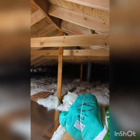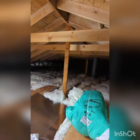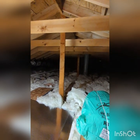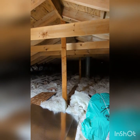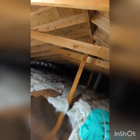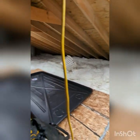The air handler is 21x57 inches, so I might have to cut some of this joist and then rebuild it, or see what I can do. But mostly so it's not too heavy, because it's a heavy one, maybe 150-200 pounds. I have to gut it all out, basically get all the blower, coil, everything. So when I bring it up, it's just going to be the casing. Because I'll be on my own, I'll get a tool, like an electric motor that would make it pulling it up, so it's easily going to climb up. Or I'll just use a strap and bring it up. Whatever makes it work easily, efficiently, without breaking my back.